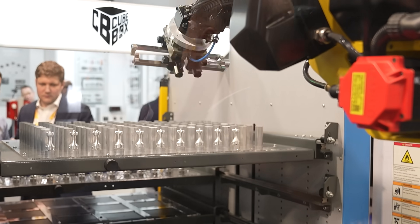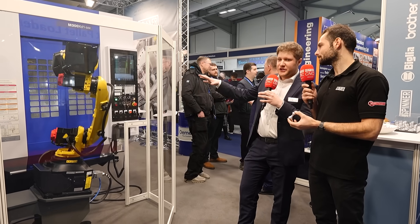Before we go more into the details of how the QBox works — why would you automate a machine like this? Well, what the machine itself gives you is something fast, compact, reliable, that can make parts quickly. And then why would you not automate it? Do what you're doing productively for more hours. There's no point reducing the cycle time and changeovers from three ops to one op — from an hour sat waiting in a box waiting for someone to load into another machine — down to 30 seconds, if you've got it waiting five minutes for someone else to load a new one in. On the other side, you've got trays of complete components ready for next operations, measurement, whatever you need to do.